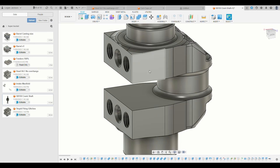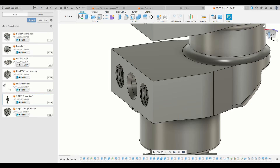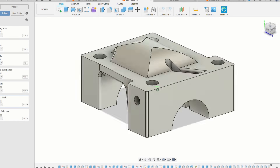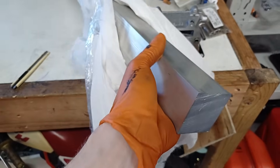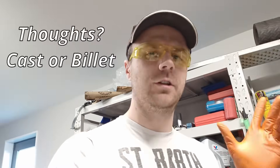So here we are looking at the crank — 18 mil is the diameter of the two webs that are 17 mil apart. We have to take into account that there is a step where the bearing seats on both sides, so we need to be careful not to overshoot that. I was also working on the cam caps yesterday — they've got two bearings, a thrust area, that's where the cam lobe will be, an oil pressure feed, and some gravity feed for the thrust part. I'm thinking of making those cam caps billet from this big piece of 6061 aluminium. They'd probably look sharper and match the rest of the engine, though I did consider 3D printing and casting them. For now I'll probably just try to do them out of billet and see how it goes. Now we've got those measurements, let's do some machining on the crank.